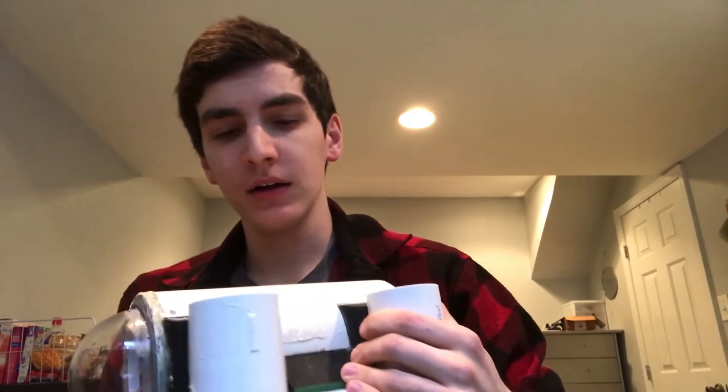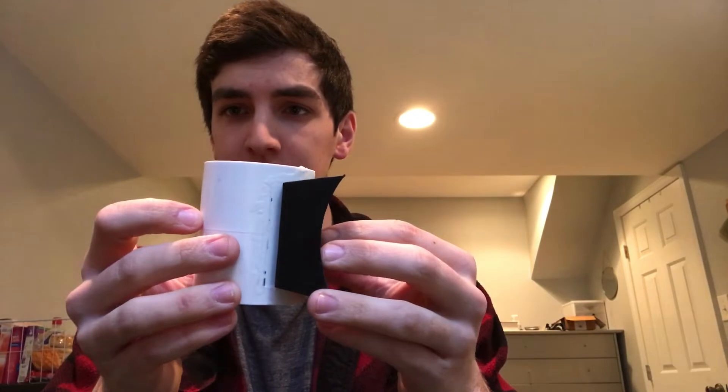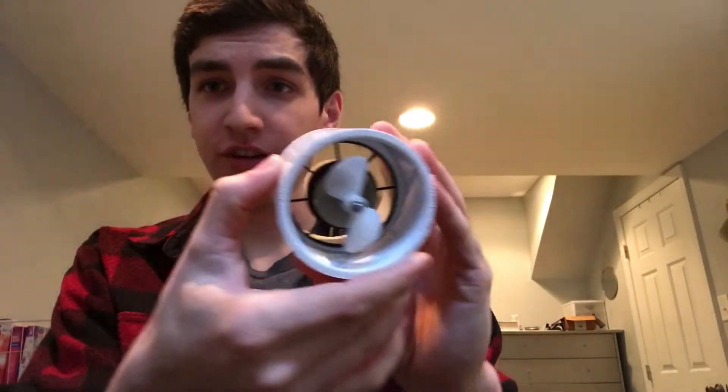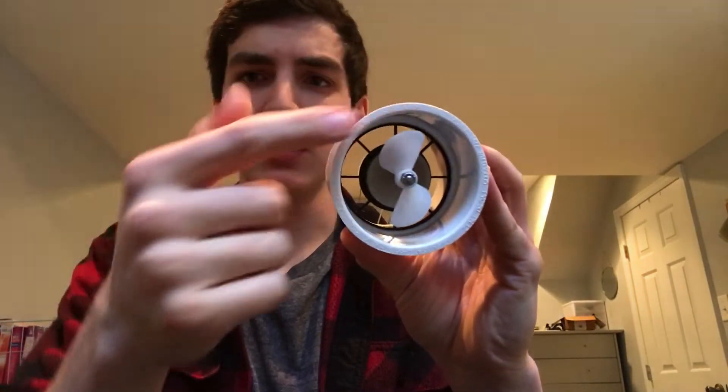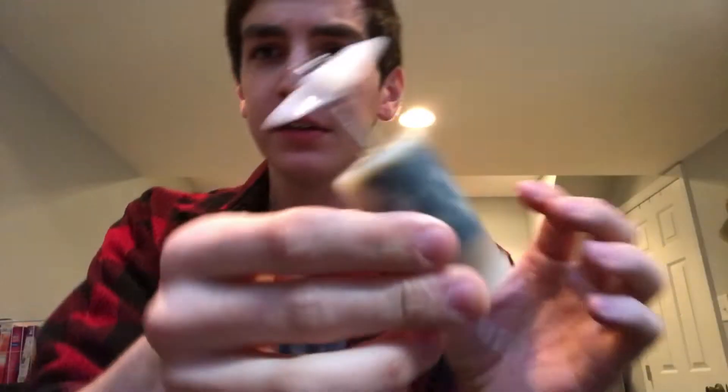Our design consisted of four motors going up and down and then two going forward and back. It's a PVC coupling and then we printed a part that adapts it and fits it to the main tube. Here's a better look at the 3D printed part — it just goes to the coupling and the motor sits inside. We 3D printed another part, a spacer, to hold it in the center so it allows water to still go through.